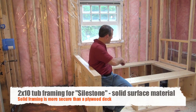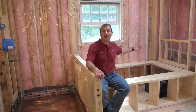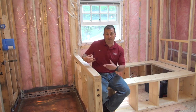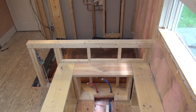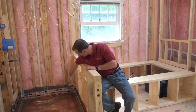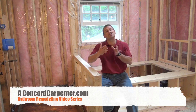The problem is we have to put our solid surface down first before we drop the tub in, because trying to sneak the inside wall piece of granite in after the fact is very difficult. This tub also requires a drain and water line connection right here. We could cut the ceiling below and do it from below, but it's difficult and incurs other expenses. So we've got to keep this end of the wall open, which means we can't tile everything before the granite goes in — there are steps involved.